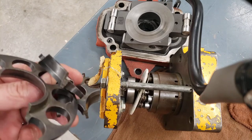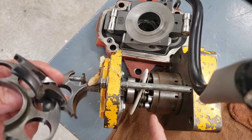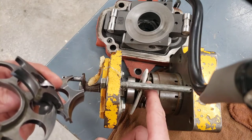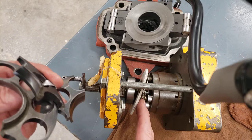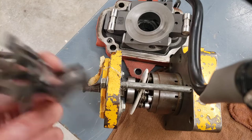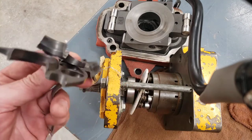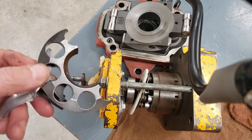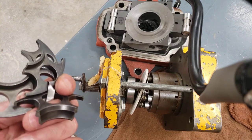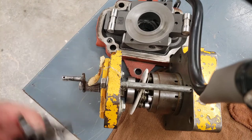Often when a piston pump fails, someone will take it apart and find a broken retraction plate. Because again, if one piston doesn't want to come out and the two neighboring pistons do, then that's going to try and bend that retraction plate. And of course, you try and bend something that's brittle and it snaps. So I've seen lots of failures blamed on this part being brittle, because it's the only broken piece you find when you take the pump apart. But that's generally a result of dirty oil.